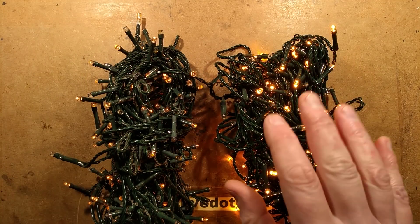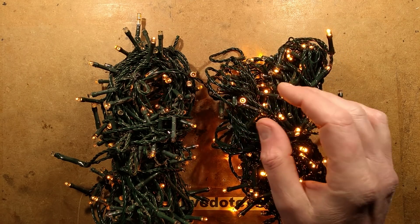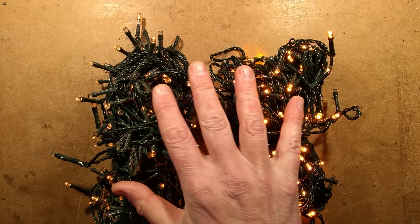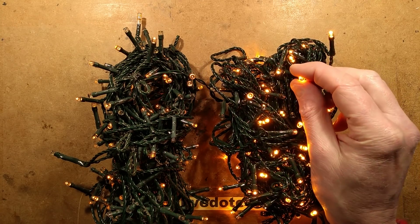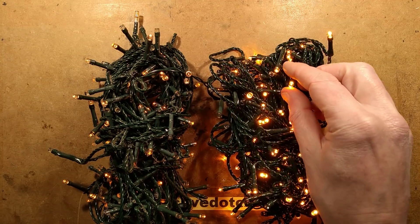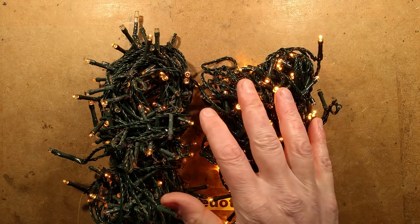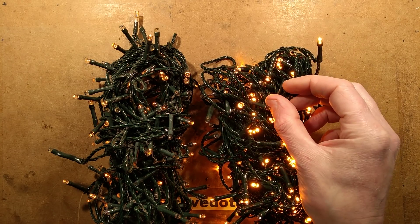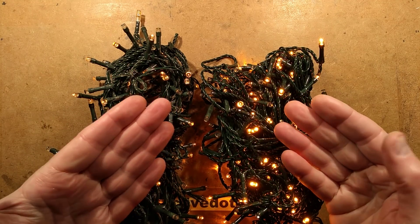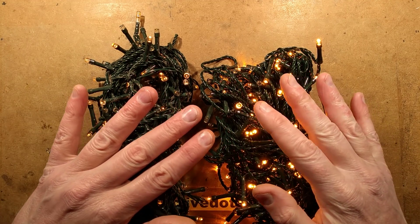The old red LED kept its intensity all the time, because older technologies like gallium arsenide and gallium phosphide — the older reds and greens — are very stable and degrade very little. Modern gallium nitride technology — the blue chips, bright dazzling green chips, or phosphor-based whites — lose intensity over time quite quickly. With phosphor-converted whites it's a double-barrelled degradation: both the phosphor and the chip degrade. This is sometimes visible as lights gradually shifting from warm white toward blue as the phosphor degrades.